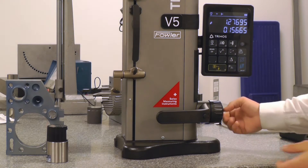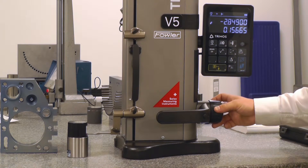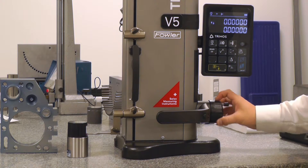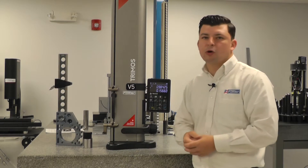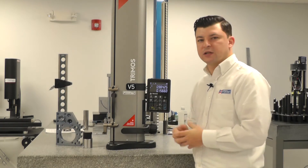The same process we did before: bring your calibration block over, engage the probe down, then up, and repeat that process — down and up. Had we changed our probe, we would have had a different probe diameter, but that is how you change your probe and calibrate it in process.